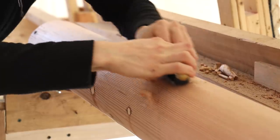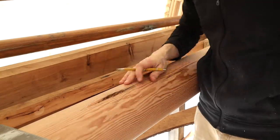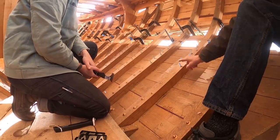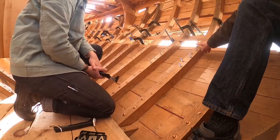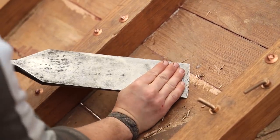The next day, Alix got back to the mast, cleaning up the cedar plugs and getting started on the graving pieces. In the boat, Steve got Carolyn going on cleaning up the area that will soon end up behind the bilge stringers. That meant cleaning off the dried dolphinite around the frames and taking any ledges off the inside of the planks to keep the crud from building up over time.